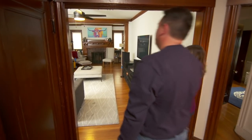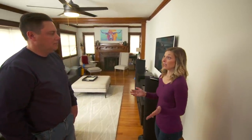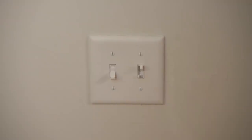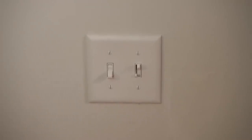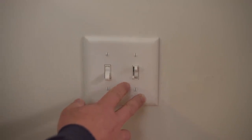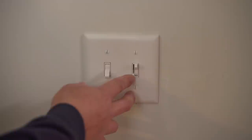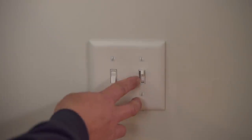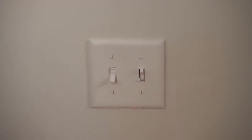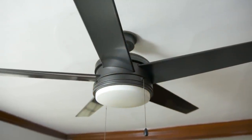So Heath, this is our living room with the light fixture I told you about. When we bought the house two years ago there was no overhead lighting, so my husband installed the ceiling fan with the light, and this is the switch for it — not crazy about it. Well, the first thing I can tell is it looks like it's upside down. The switch is upside down, and the way to tell is that typically this dimmer would have the slide on the right side and not the left. When you push it up, it actually dims down on the slider, and when you push the slider down, it actually raises the light fixture. Yeah, it doesn't totally make sense. So let's take a look and see how it operates — it looks like it doesn't work too well for what we're looking at either.